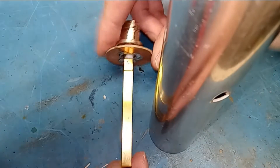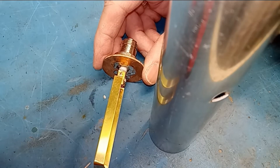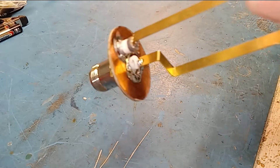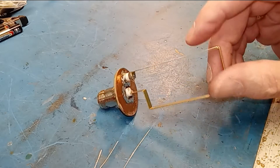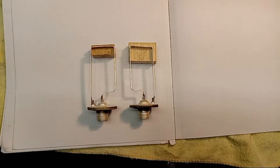I discovered I had a mechanical alignment issue between the coupling loop and the base. It was difficult to get exact 90-degree relationships between the loop and the base. I ended up using a small piece of wood to make an alignment fixture to hold the base and the loop correctly aligned when they were soldered. The prototype loop worked very well, and these capacitors allowed enough tuning range to cover the frequencies I need for both transmit and receive cavities without having to change the size of the loop.